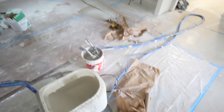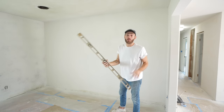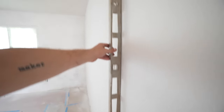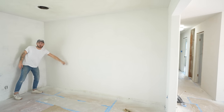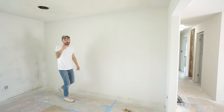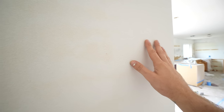That's it — I can't believe it but we're done. I'm going to clean this machine up and get it purged with water so it'll be good to return. I just got back from returning the tool to Home Depot — I couldn't be more hyped with the results. This wall in particular was one of my bad ones — you can no longer see the visible seams where the drywall panels meet. If you put a straight edge against the wall, there's no light shining through, which means we're flat. The hallway ended up looking great. A little bit of staining bled through the new texture, but once we get white paint on, you won't be able to see it after primer.